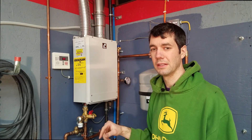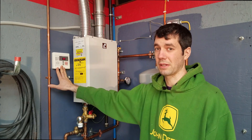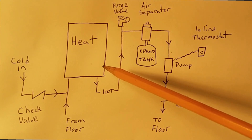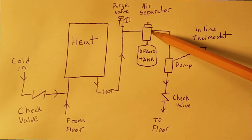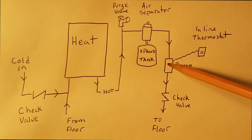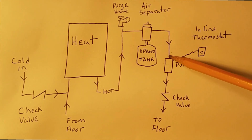You can set the temperature anywhere from 99 degrees up to 167 degrees. This system is called pumping away, where the pump is located on the hot side of the heater. When the water gets hot it gives off gases — we have our air separator right here. Also, when water gets heated up it expands, so we have our expansion tank. By putting the pump on this side, when you create less pressure on a fluid it releases more gases, which is fine. We have the air separator on this side, and when the pump first turns on it creates lower pressure where the expansion tank can help.